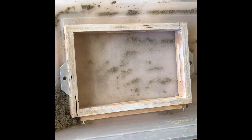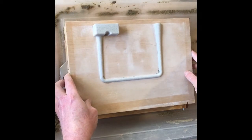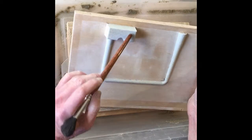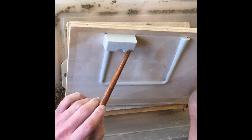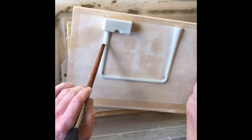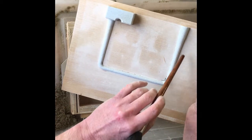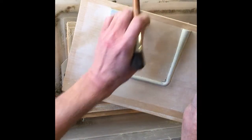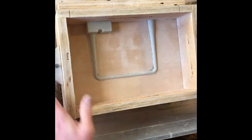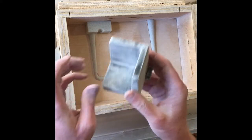I'm going to demonstrate something I've been experimenting with — the idea of casting sideways. What I have here is the pouring, the offset pouring basin, and then a tapered sprue going down to a runner and then back up into a surge trap bar. This is just the running system, and then we'll get the pattern.